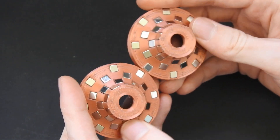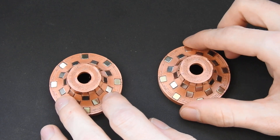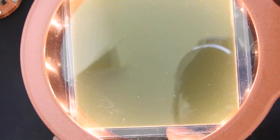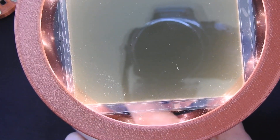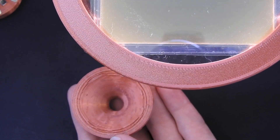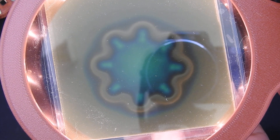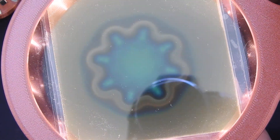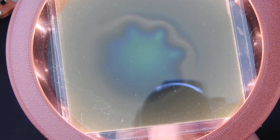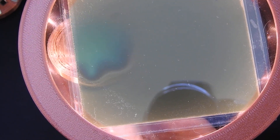I will show you with a gauss meter and also with a magnetic viewing film the field shape and interesting properties of these arrays. First I will take my field viewer — this is a color gradient field viewer with an LED strip around it, so you will get a nice holographic image of this field. I take the magnet array and put it underneath the field viewer, close to it, and then you get this shape. Now I will just rotate it underneath so you can get a better holographic view of it.